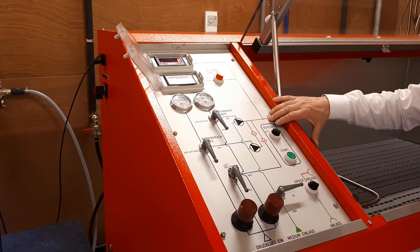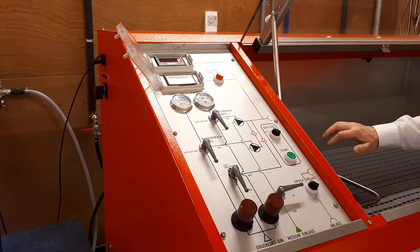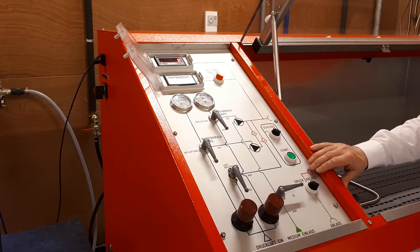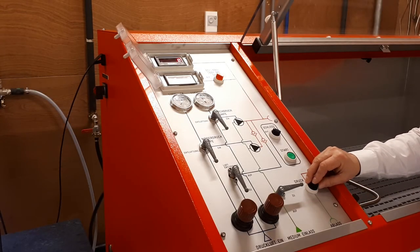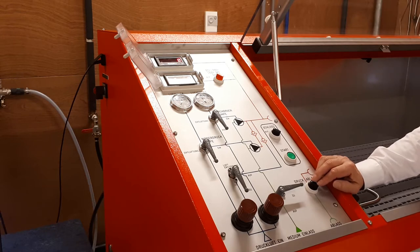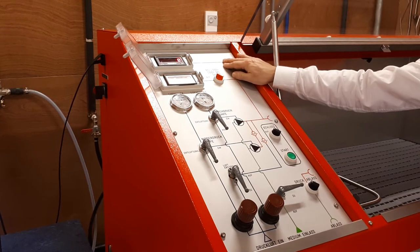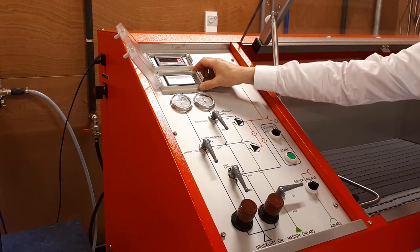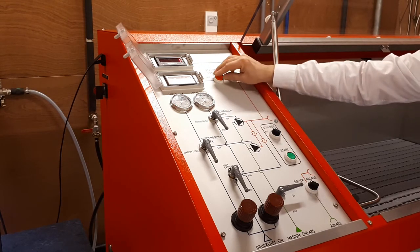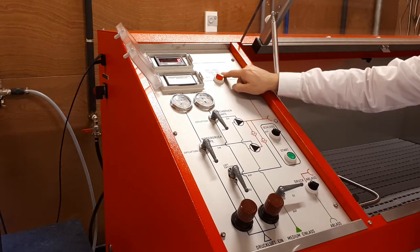About the red lines: from the high pressure pumps we go to the inlet high pressure bulkhead connection in the test chamber. The other high pressure connection is the return bulkhead connection. By controlling the switch you open or close the air operated high pressure valve, which is used for visual de-air indication or to release the test pressure on the hose. Also connected to these red lines are the digital readouts — one for the complete range and one for accurate measurements at low pressure. This low pressure readout is opened or closed manually with this switch. When the test pressure goes above 250 bar you should close it.